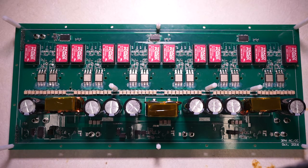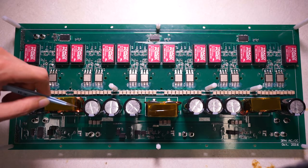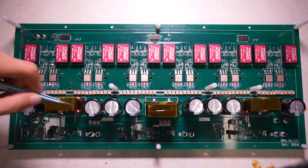This is a prototype of our three-phase AC/DC converter. We use 12 1.2 kV silicon carbide MOSFETs to deliver 25 kW total power. Here, these parts are switching devices, these are driving circuits, these are DC link capacitors, and these are converter side inductors.